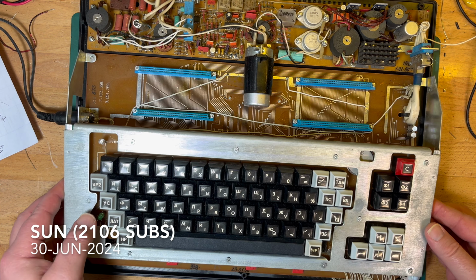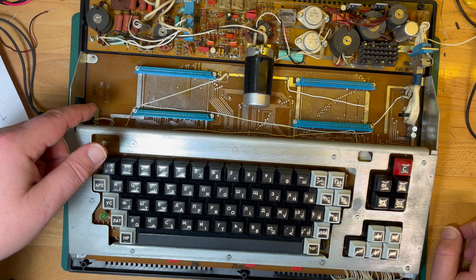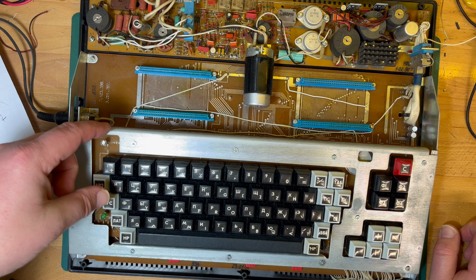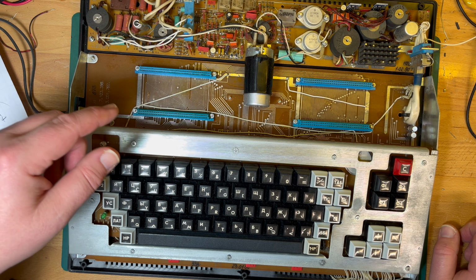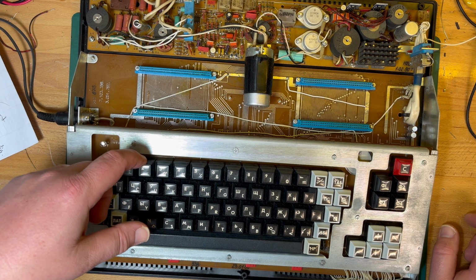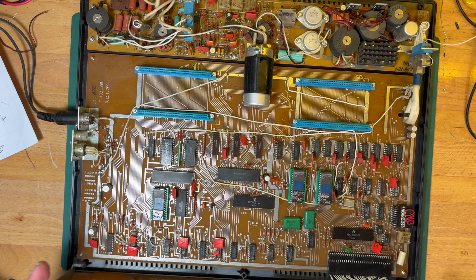So remember the Partner 0101? Where we left it last time is we were trying to load some software via the magnetophone port. So it was RKP-format, which is the archive format they use, I guess, converted to WAV form. So it was loading, but then we would get Oshibka error. So there was an error loading it. So I tried a test program and I tried Pac-Man, and neither worked. So I was looking at it last time.